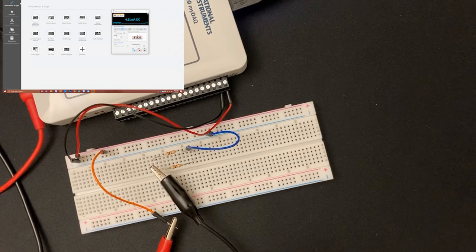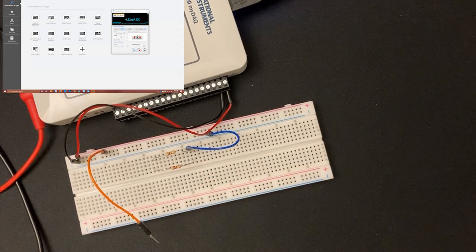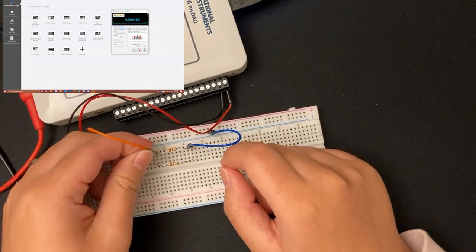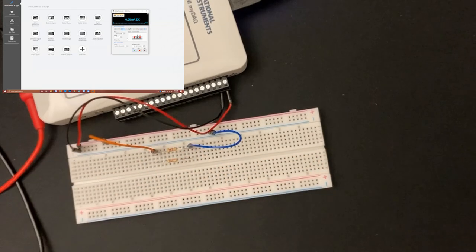That's pretty much how you measure voltage across and current through two resistors in series and in parallel — and really it's the same procedure for measuring through any circuit component. In EC240 you'll be doing a lot of experiments like this, measuring voltage across and current through resistors. These are general methods and if you were able to follow through this video, you'll be in good shape to perform any other experiment. Thank you for watching.